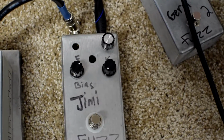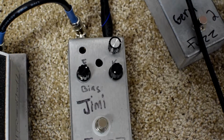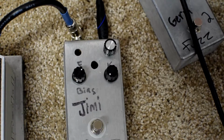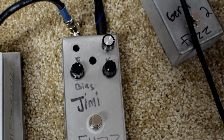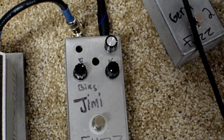We've got a volume knob, and then this guy is actually a, there are two input capacitors, and so basically it's kind of like a fat versus bright roll-off switch. So right now it's in the fattest position, which is the authentic fuzz face, but then if you want something that's more cutting for lead playing, you can turn it to the right. Really enjoy that pedal. It's Brothers over there, but that one, the battery died, so.